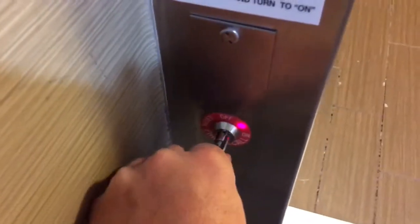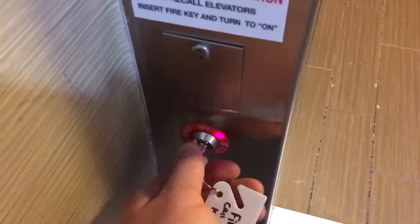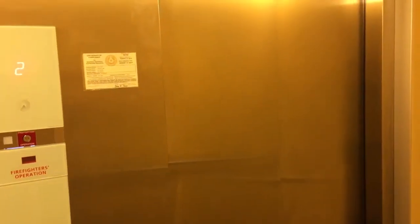You'll put the key back into the hole and turn it all the way to the left to where it says reset. You turn it all the way over to reset and then turn it off, and now the elevator goes back into normal functioning mode — the fans kick on and the normal door chimes and everything will work as well. If you liked the video, feel free to comment, subscribe, and hit that like button. Until next time, stay curious.